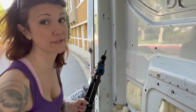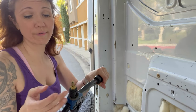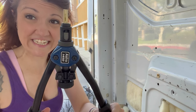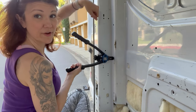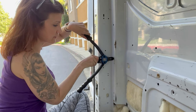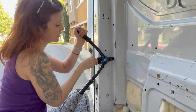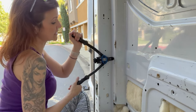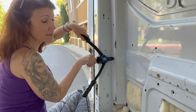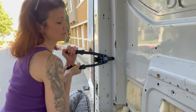There's one more thing I want to show you that might make it easier, especially if you struggle with upper body strength. You don't have to have the handles all the way out or thread this all the way down if you need a little more leverage. See how much gap there is? I can move the handles to here and pushing like that gives me a lot better leverage — instead of pushing from way out here, I'm able to just squeeze together. Obviously that's not going to be tight enough, so I just screw this in a little more. If the nut is spinning while you're doing this, just push in that way while you're tightening — that helps a lot. Just do it a little bit at a time, don't tighten it all the way, get a little bit more, then do it again. That makes it a whole lot easier — more steps but much easier — then just keep doing it until it gets too tough.